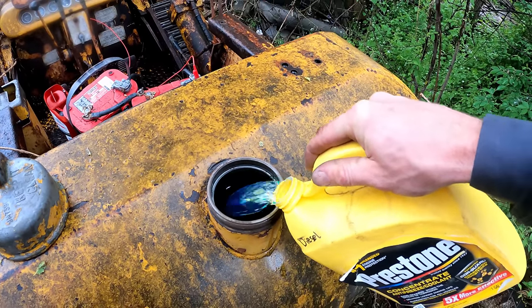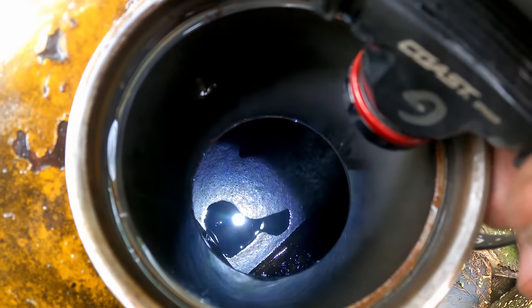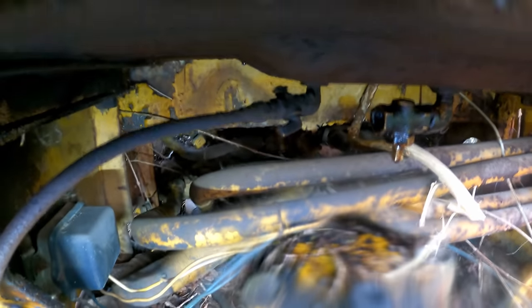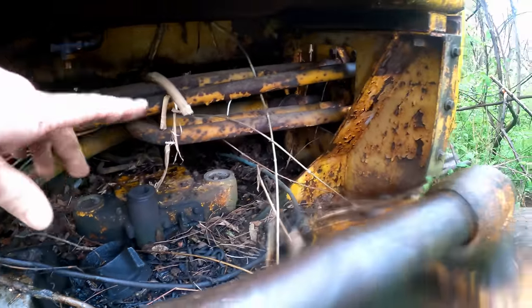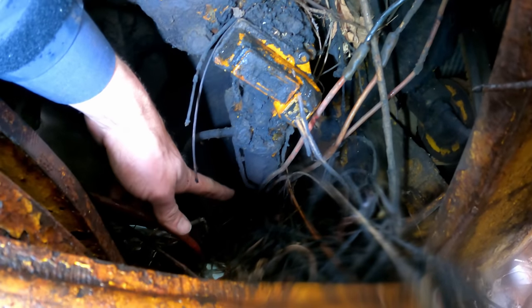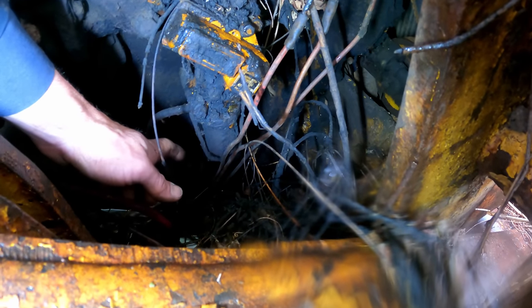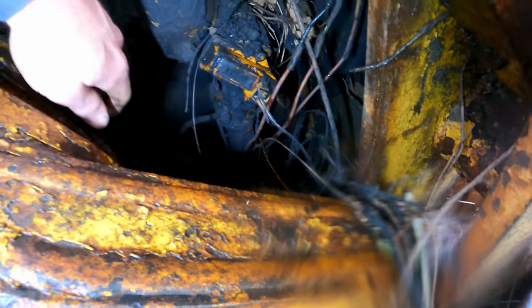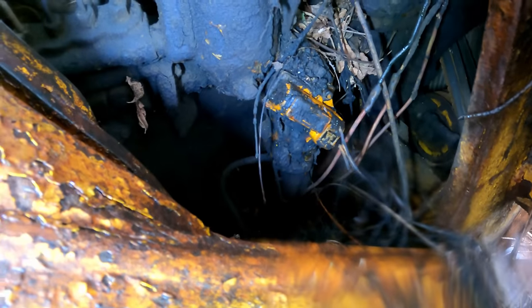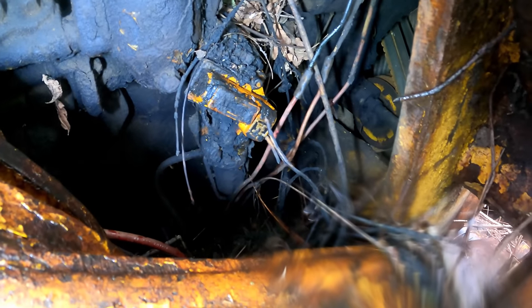I'll start with 1 gallon of diesel I happen to have kicking around. That should be enough to get things going. Oh yeah, that'll be fine. Let's fire this valve up. And I got a copper line leading up front that comes in all the way up here on the bottom. That looks like a little fuel strainer, a water separator. The good idea would be pulling this bowl off and also removing this lower screw on the filter, check for any water, but I don't want to lose the prime in the fuel system. Let's just crank it up, man. What do you got to lose, right?